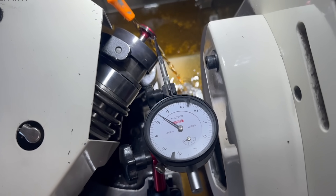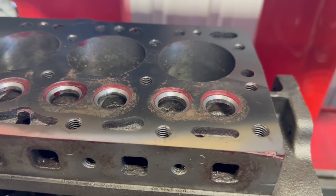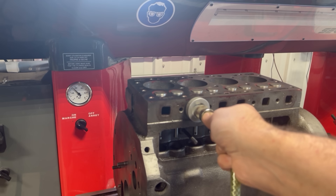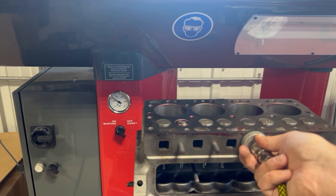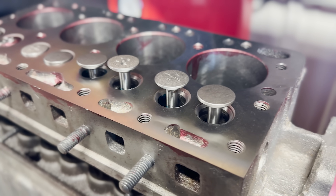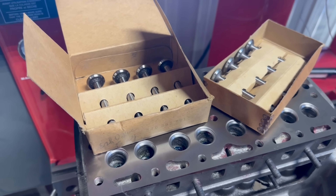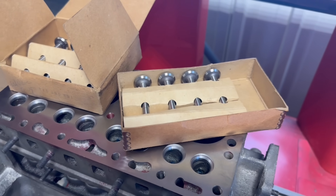We always talk about rust being like a cancer, and after just a couple of days the surface rust is already reappearing on the second block. This rust is all within the chamber area and won't affect any gasket sealing, but unfortunately it's simply not pretty. Regardless, we went through and did our final vacuum check, and then put the first block back up on the machine to vacuum check those seats as well. Everything passed with flying colors, and we're very happy with how these blocks came out. For now, we'll oil them down in an effort to prevent any further rust and box up the reground valves, while we continue the search for pin bushings that we need to recondition the connecting rods before these blocks can be reassembled. Thank you all for watching, and we'll see you in the next one.